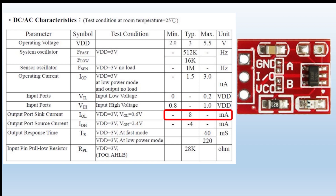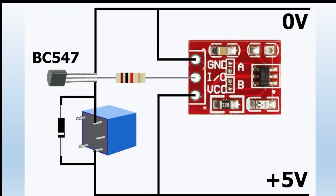If we want to use it to drive a higher current device, we can use a transistor. Touching the plate changes the output — bringing it high will switch on a BC547, which allows current to flow through the relay, and then you can take those output terminals to switch higher current or higher voltage devices. Note: you don't normally see zero at the top and five at the bottom — I had to do it that way because that's how it looks on the switch PCB.